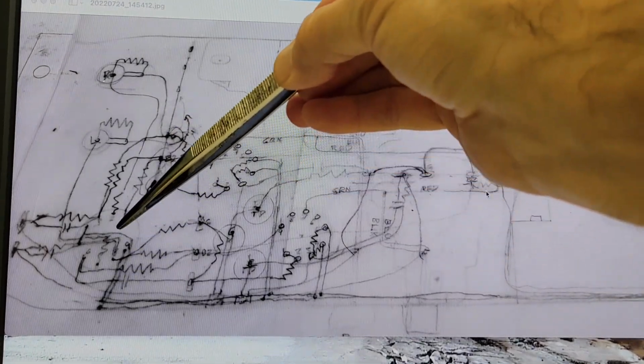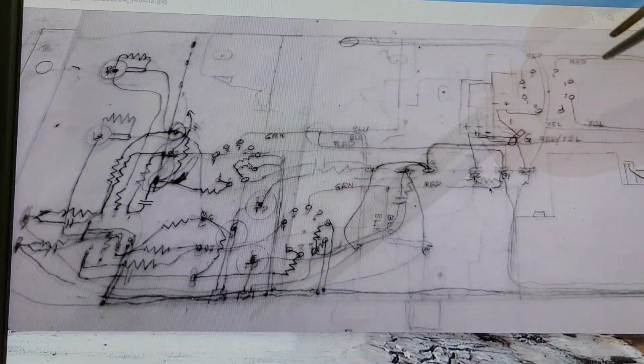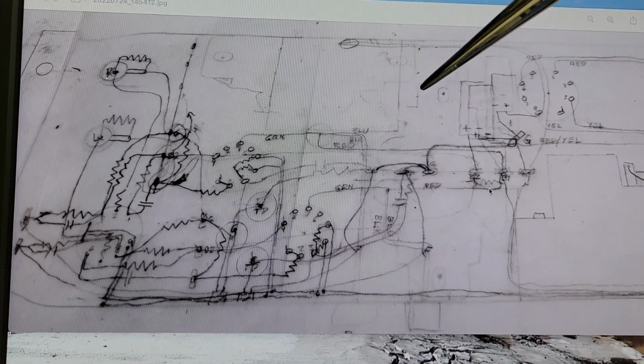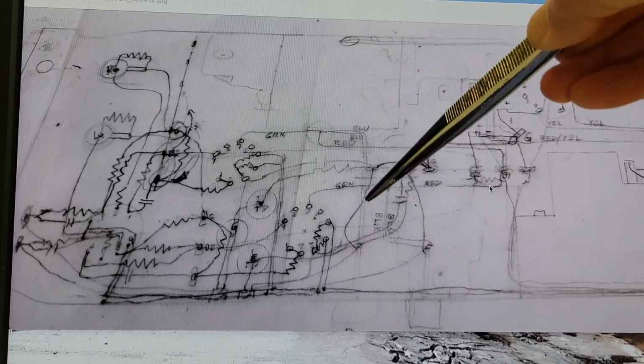So looking at some of this, let's make this crossing at right angles, especially since this is an AC heater line. Let's see, output then of course comes from the output transformers here and here. So to one channel, to the other channel. And that's all there is to it. So as you can see, that gets a bit complicated. So if you didn't follow all of that, I think you can probably understand at least the need for drawing it out in the first place. That is, having some kind of plan, one that is erasable and revisable as you go.